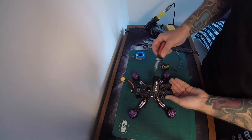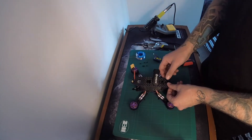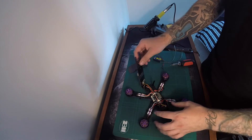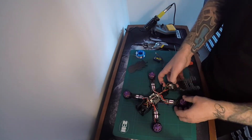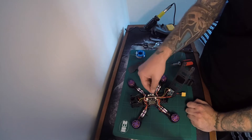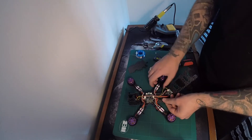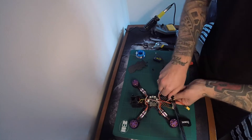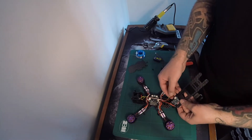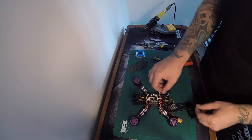What I'm going to be doing is unscrewing all six bolts and taking the top plate off. Just take the six screws out, take the lid off, take all the side panels out, and break it down so you've got some space to work with. The camera can stay where it is for the time being. It's mainly the back area we're going to be working on, so we need to clear that out. The best thing to do is remove the back poles if you can — more space is better. You can also unclip the VTX to give yourself a bit more room.